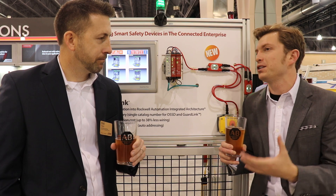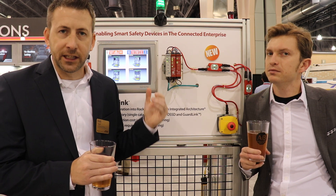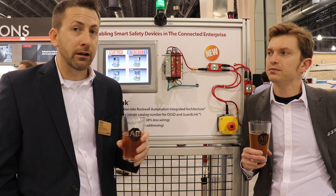I'm excited to have you here. You're an expert when it comes to our safety solution, so give us some background on the problem. What problem are customers facing when it comes to safety and uptime right now? A lot of our customers tend to use one safety relay and then wire a bunch of doors or different safety devices in series, and when you do that it's really hard to troubleshoot your safety circuit. If anything goes down or a door is barely open, it may take them hours to troubleshoot to see exactly where the error is.